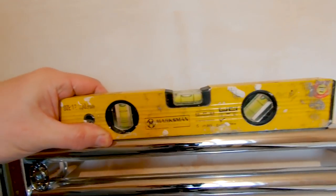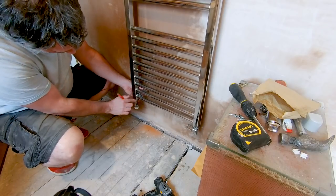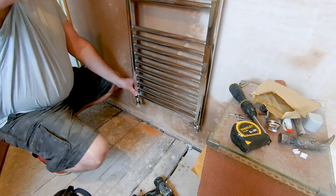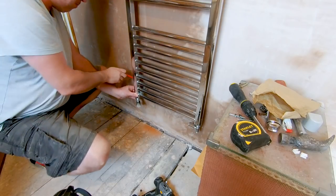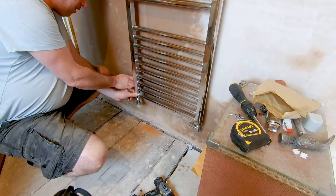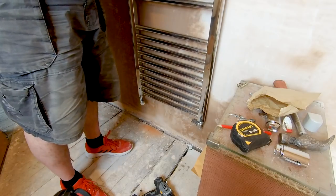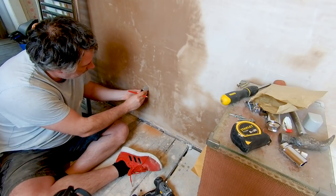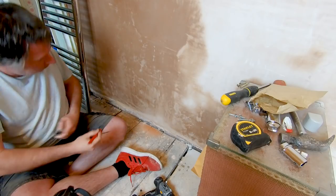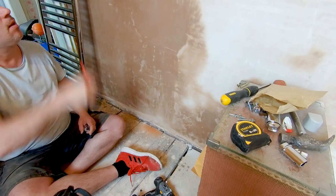While we're at this stage, we can put our spirit level on top - it's pretty much dead central, close enough for me. So what we'll do now is take one of our other brackets and slide it in behind there, keeping that distance between the edge the same as up here. Just get your pencil behind there, make sure that's nice and flat against the wall, and just draw around the top of it, this side of it, and down the bottom. Same with the other side. Then lift these back off, put them back on your pencil mark and mark right in the centre.